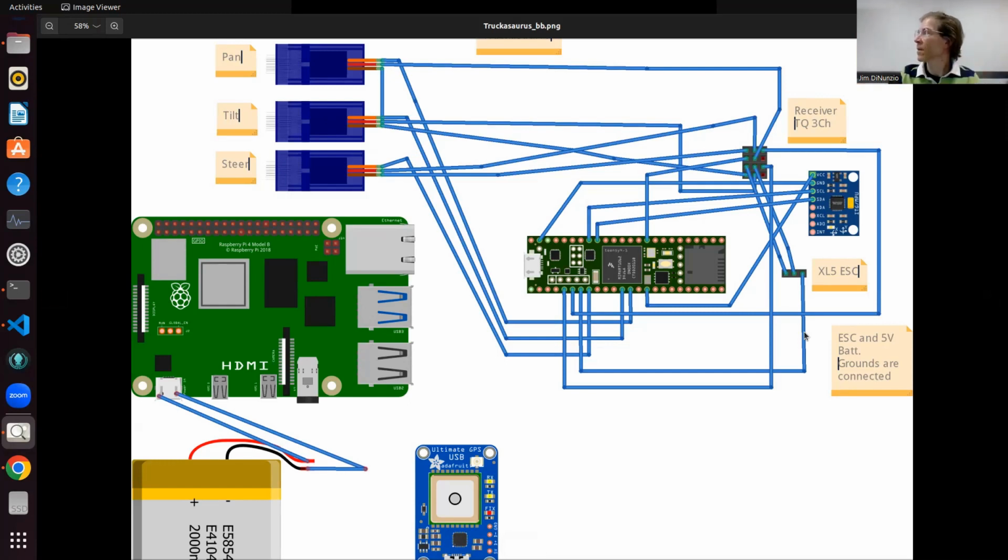For anyone who doesn't have a lot of experience with that: why wouldn't you just do it the opposite way? Why wouldn't you just have a button to press if you want it to stop? Why do you have to hold it down? Well, they call it, I hate to use the term, the dead man's switch. If the car goes out of range, or for whatever other reason, it has to be the other way. For an emergency stop, it has to be loss of the signal rather than gain of the signal. Because what if your signal strength is dead, your batteries die, you're out of range? The robot will keep going if you need to send it a stop signal. This is a keep-going signal: if you don't receive it, stop. That's the concept. So in a contest, I have to keep within distance of the remote, or the robot will stop.